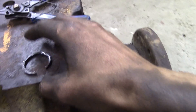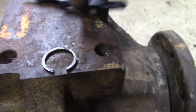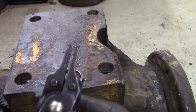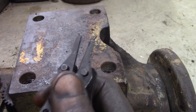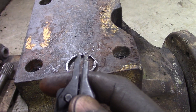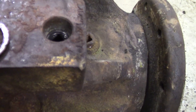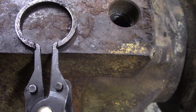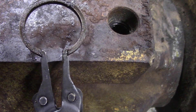I will digress for a moment — these circlips suck. Functionally they're good, but man are they a bitch to get off. So what I did: I had a spare set of tips for my snap-ring pliers, and you can see I ground some little chamfers on them so it perfectly addresses the angled ends of the C-clip.